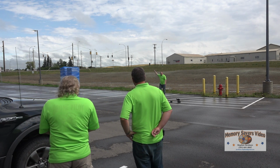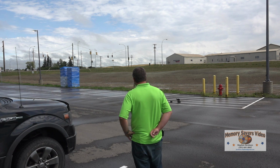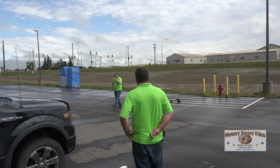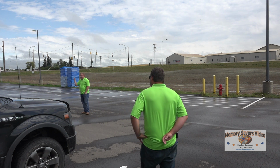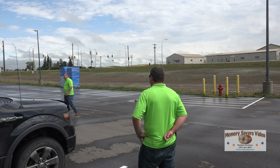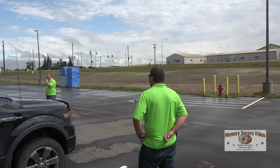This right now is communicating with up to about 40 different satellites, about 12 different constellations or patterns. And what that does is it takes the accuracy of the GPS and it shrinks it down to about a centimeter, or give or take half an inch. So that when I'm flying, the drone knows its position accurately to within half an inch.